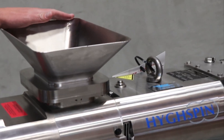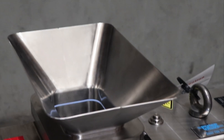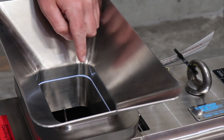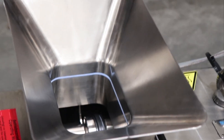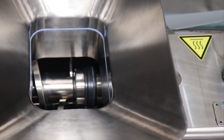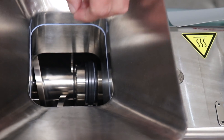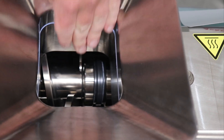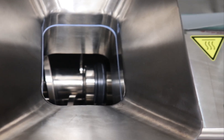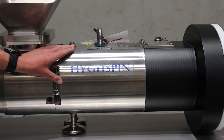On top, this particular pump is hopper feed. An interesting feature — which is not a standard feature — is that the actual feed screws in here are extended. This has the effect of having your food product drop in here, and then the extended feed screws will actually grab it and pull it through into the actual twin screws, where it gets pumped away.